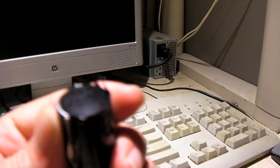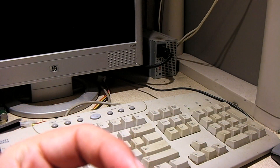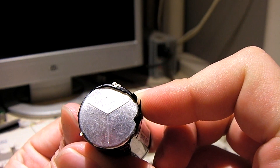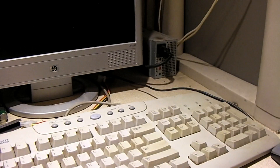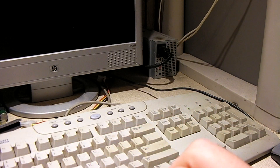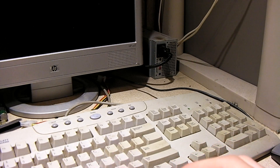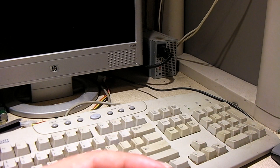All I've got to do here is just peel off this. And there you are — look at this. It's not leaking yet, but you can definitely see some bulging. Interesting to see that the OST primaries take on a Y-shaped vent rather than a plus. Let me do the same for the other one — and they are in fact bulging. Now, I mentioned earlier that usually the primaries don't fail that often. Well, sometimes they probably do — they just don't actually bulge up like this. It's not very often you see the primary caps bulge up and leak.